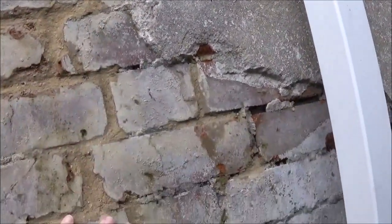Whilst people discuss rising damp and how water rises up the bricks, my personal view is that it doesn't really exist. And all this is as a result of splashback and penetrating damp through the wall. This wall is in the direction of the prevailing rain, so whenever the rain comes in, it smacks this wall constantly. The other side of my house is fine.